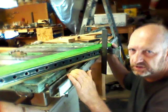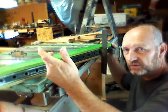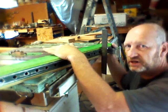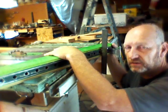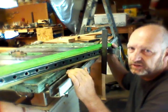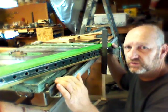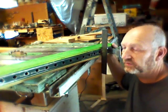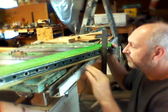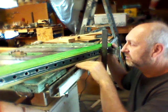I haven't really had an issue because I just set the guide that rides through the track farther forward on the crosscut sled, so I can pull it back farther before it hits. It works fine for me, but that's one thing I messed up on that I wish I'd thought of. My tip to you: make sure you leave this low enough and compensate with a spacer so that if you do have a crosscut sled, miter sled, or whatever you're using, it will clear this when you pull it back.